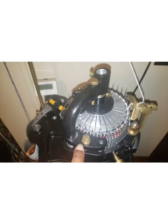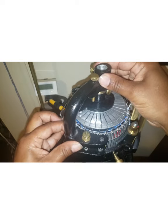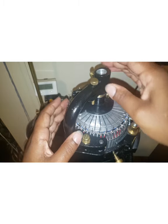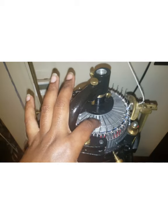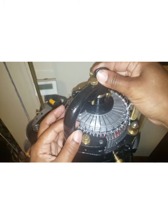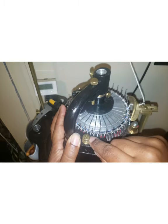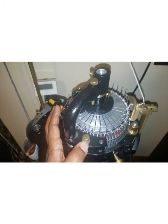Okay, so this screw right here controls the height. And your ribber needs to sit a certain height from the cylinder in order to knit well. I found that my ribber seems to move smoothly where I am fairly deep inside of the cylinder, but not so deep that it's below the cylinder line. So basically the bottom of the ribber dial is just a tiny bit above the cylinder. And so when I get it adjusted where I like it, I turn the bolt, and the screw is sitting all the way down here, and this bolt keeps the screw in the right place.